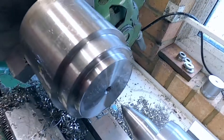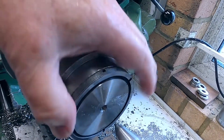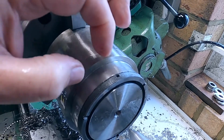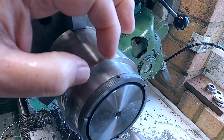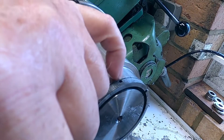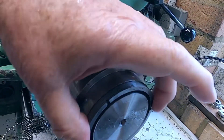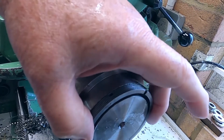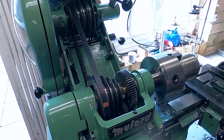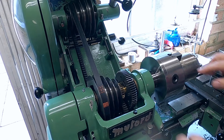It's just slow going. I've managed to machine all that away and it will just go on nicely. So now I have to cut this off to enable me to weld a nut or hex head on the end of it, and then I can screw this in and insert some pins into this shoulder which will engage in these three slots. Slow, steady progress on a big lump of stainless steel on my tiny little Myford. I'm going to engage back gear because I intend to turn this very slowly and then allow a tap to draw itself in.